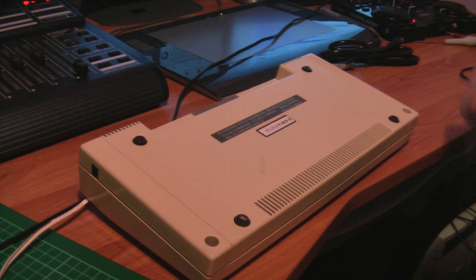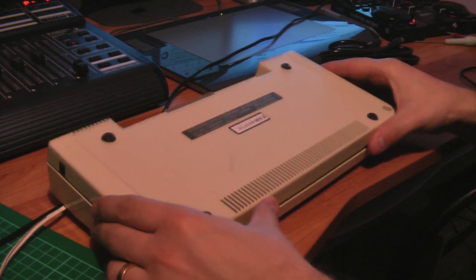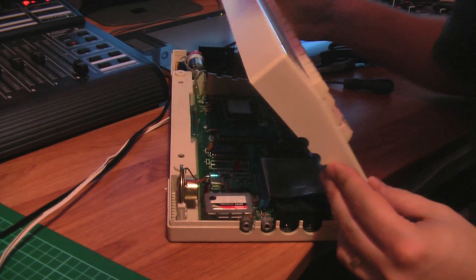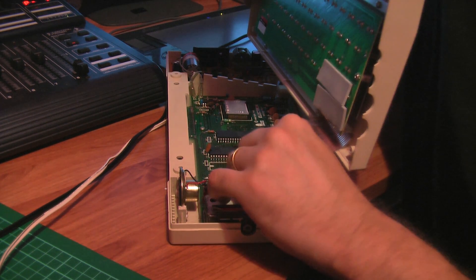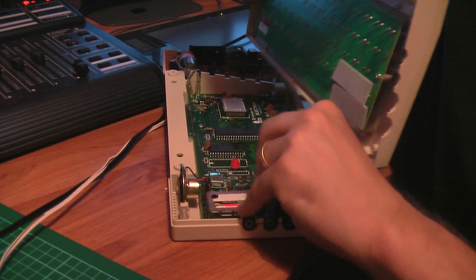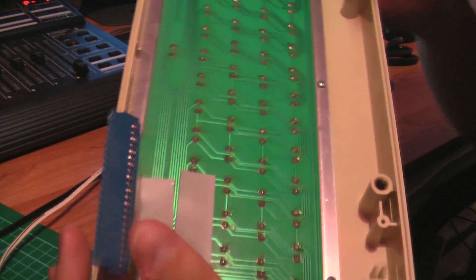Well, let's look inside. First we'll remove four screws, which are located here, here, here and here. But here's one I talked about earlier — separate that unit and turn it over. Lifting it up rather rapidly, you'll find that you rip the ribbon cable in half. Yes, this dirty great big ribbon cable runs from the main board to the underside of the top shell, which goes into the keyboard — which I have to say is much more robust than its Sinclair competitor.